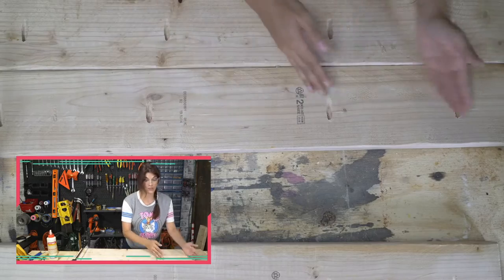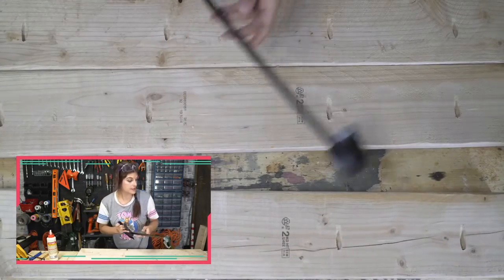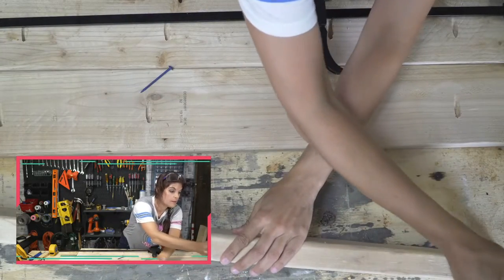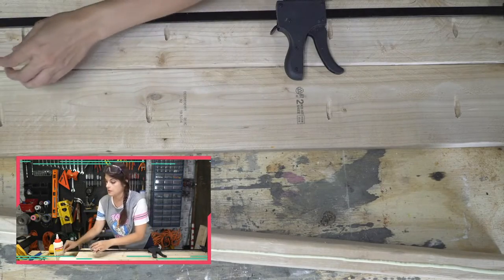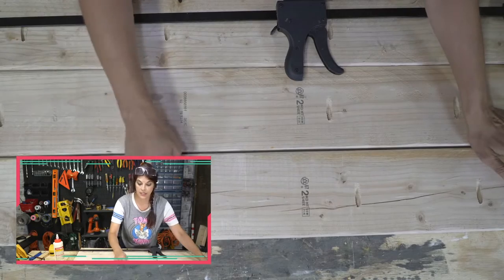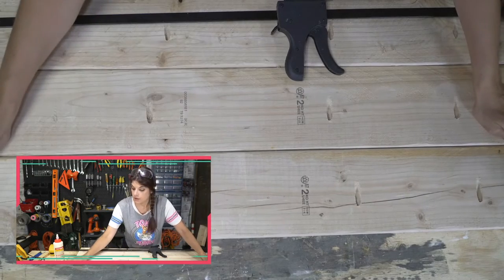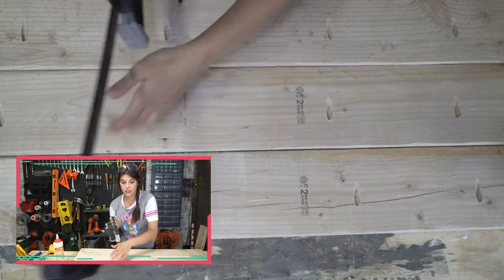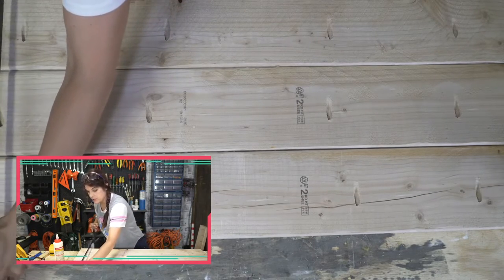And so now we're gonna do the same with these and this third piece of wood right here. So let me unclamp it. And let's get some glue going. And I tried to pick the prettier sides to put on the other side. You'll notice that these have a lot of stamping and markings, and you can certainly sand them off. The words I was looking for. Especially if this side were gorgeous and it's got a couple stampings, yeah, you can just sand it off. But I thought the other sides were prettier.